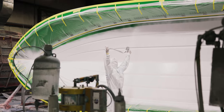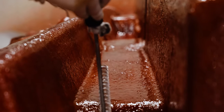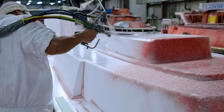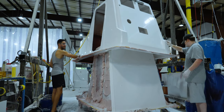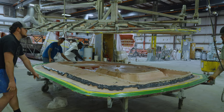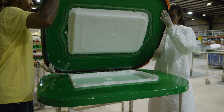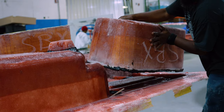Recent events have caused incredibly long wait times on components, which adds complexity to this already complex operation. Next, we start our lamination process. The lamination of the large parts of a boat can take anywhere from 7 to 14 days. The parts are built simultaneously in different areas of the building, allowing us to shorten the total build time. Each area is carefully scheduled to ensure that the next team down the line has the parts they need. Medium-sized parts, such as consoles and hardtops, require multiple parts to be bonded together and take anywhere from 2 to 5 days, with some requiring additional time for finishing. Small parts — like lids, livewells, windlass trays, and cooler boxes — take 1 to 2 days to complete, and each boat requires anywhere from 10 to 20 of these small parts.